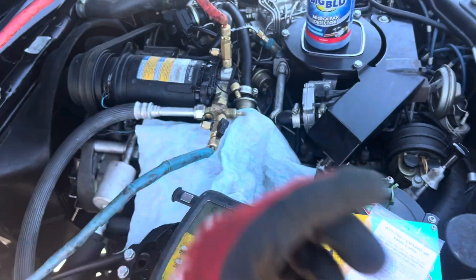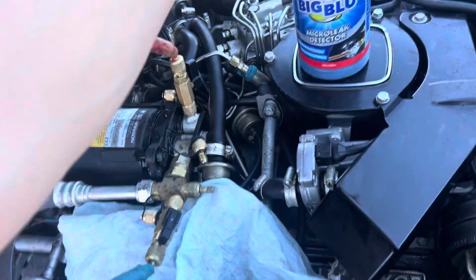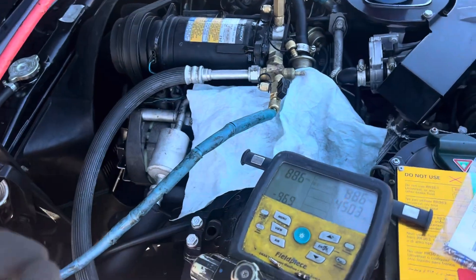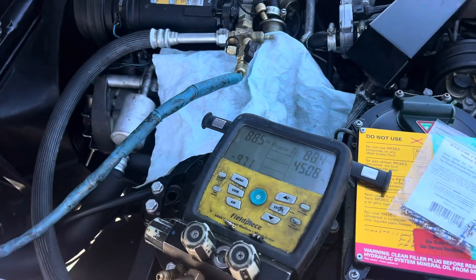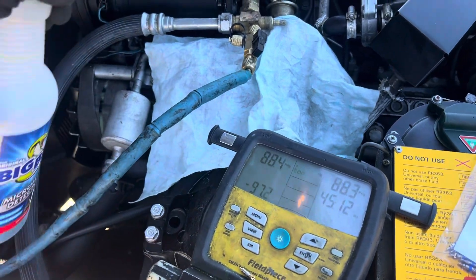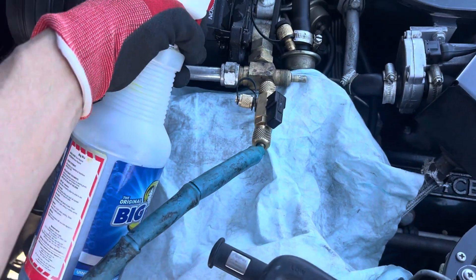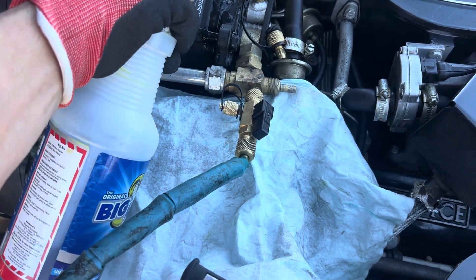Can you hear that? I tried to put the microphone right down to where it's leaking. You can see where I put the big blue soap solution. This leak gave out later — after I left, it went 15 to almost 20 minutes with no leak, holding steady. Then as I was coming back, the seal blew out. It was only 180 psi — remember, these can go up to 450 psi. This is really common on the old A6s. That's a shame because this is a nice compressor.